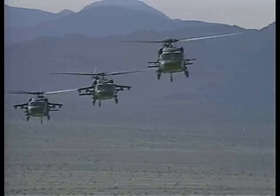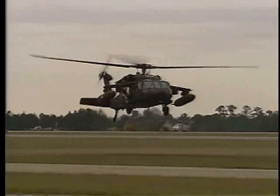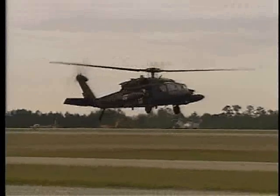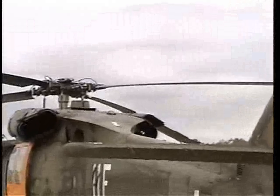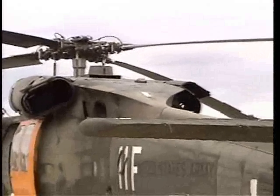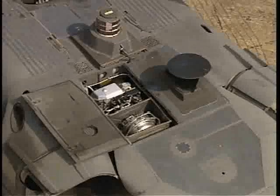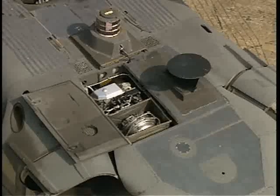Although there are 3 models of the Blackhawk used by the United States Army, for the emergency responder, the controls and switches are the same on all models. The UH-60 is equipped with 2 turbine engines. They are mounted, one on each side, just above the cabin doors. An onboard APU is located on top of the cabin between the main engines.